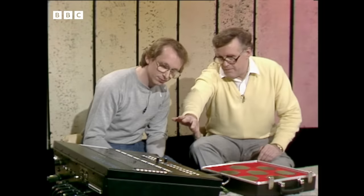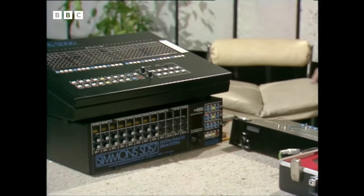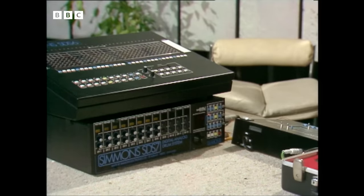There are effectively three computers here. It's a modular system, so it can take 12 channels — we've got eight here. The sound storage for each channel can be anywhere between 8 and 32 kilobytes. There's a ROM sitting inside — in that particular unit, there's 1.5 megabytes of ROM, and it's mixed in with analogue sounds and filtering and noise to make other drum sounds. Why the hexagonal shape and not round? We couldn't afford a circular saw, so we bought a straight saw instead. But seriously, anybody that sees the hexagonal shape on TV knows it's a Simmons kit, and that's what we want.